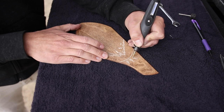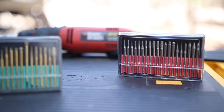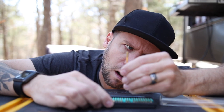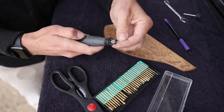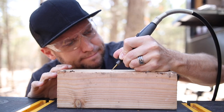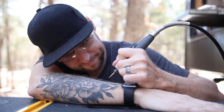The flex shaft is worth its weight in gold. It allows you to hold your engraving bit more like a pencil, as opposed to holding the entire motor housing, which is much more clumsy. This way you can get a lot finer detail in your engraving. The actual engraving bits I use are really nothing special — you can get a set for around $8 on Amazon or a similar price at Harbor Freight. They do wear out over time, so I just consider them disposables. They work really well until they wear out and then I throw them away and buy new ones. Higher-end bits don't really work much better and aren't worth the money. Once you have your flex shaft and engraving bit chucked into your rotary tool, it's really just a matter of tracing what you've already drawn onto your guitar. If this is your first time, definitely practice on scrap wood — not just a random 2x4, but try to practice on as many different surfaces and materials as possible so you can get a feel for how your engraving bit is going to handle in different scenarios.